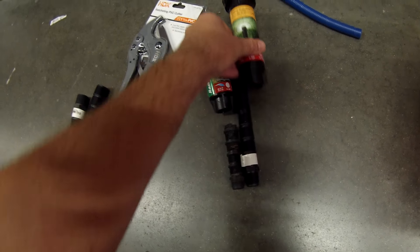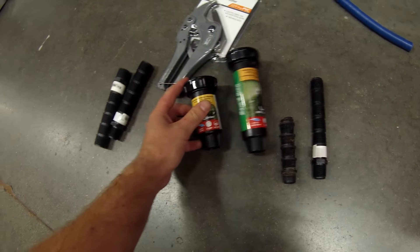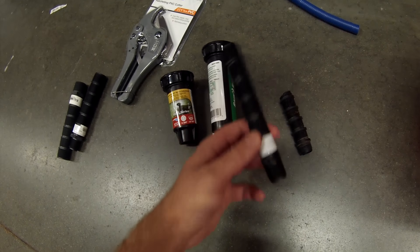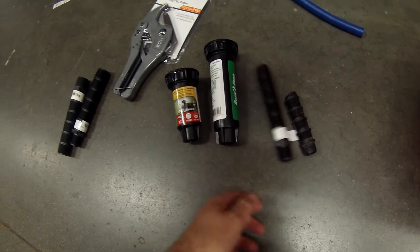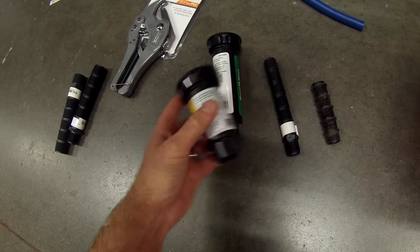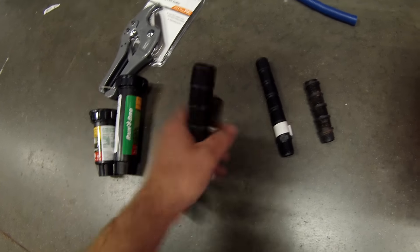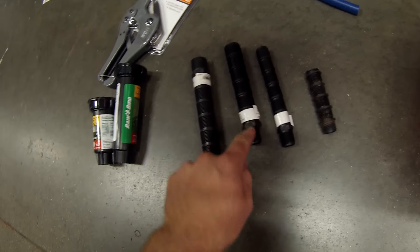This is the problem here — this is the sprinkler riser and as you can see it's kind of ragged on the top. This is what broke; the actual sprinkler head just snapped right off. What we're gonna do is remove this black piece, which is the riser. This white piece — the T — stays as part of your sprinkler system. We're gonna remove this riser, take it to Home Depot, get it matched up, and get a new one to install.